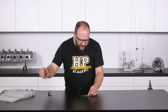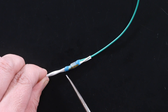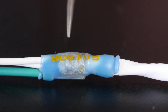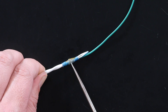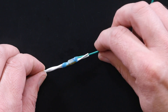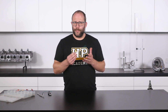After applying heat, we can inspect the result. What we're looking for to confirm a successful solder melt and a good joint is: the potting or sealing compound has squeezed down to the ends making a good seal to the wire underneath, and we can no longer see any red colour in the centre — it's all melted and flowed away. What we can see looks like the shield braid underneath, but it has been penetrated and bonded with solder. A quick tug test confirms everything is in place — a really tidy and reliable way to connect to the shielding braid on a shielded cable.